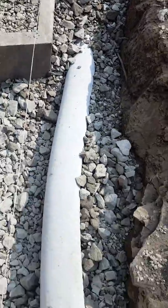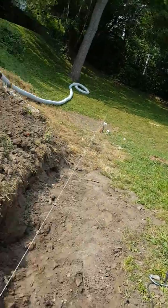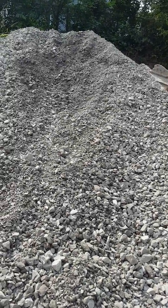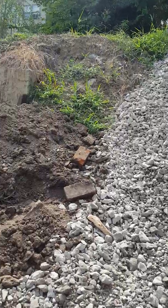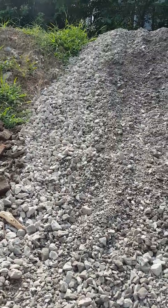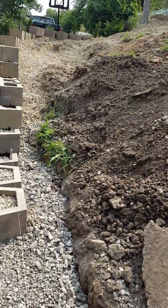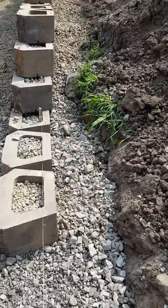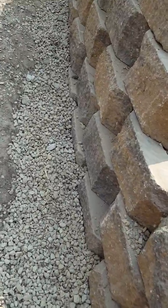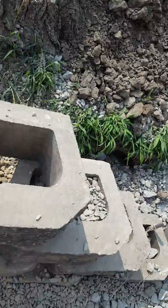And then you've got to have your drain tile — big long roll, like a big anaconda going across the yard. It'll head on down that way. Got lots of rock here, a good base. I got 10 ton of rock sitting here. It's an 80-foot wall altogether, counting the corners. I got 10 ton of rock — large rock, one-inch down, supposed to be one-inch only. And then I got some three-quarter inch rock, 10 ton there. This drain tile started at the top and moves all the way down. Got rock out here in front — real important — lets water come underneath and around. Every cell needs to be packed to the top so you don't have wasp nests and whatever else wanting to live there.